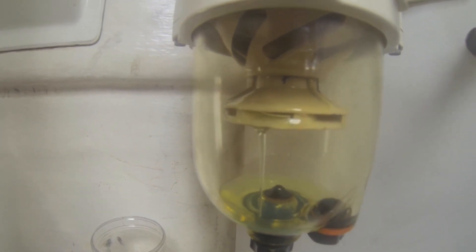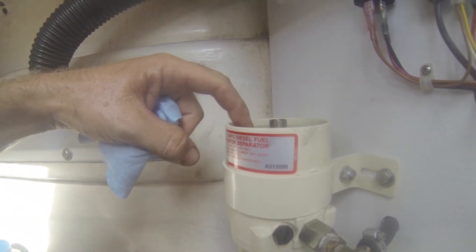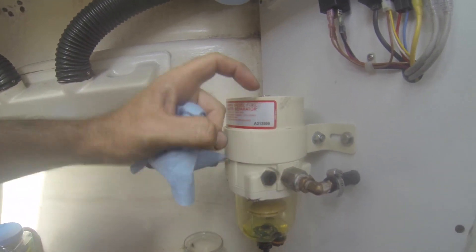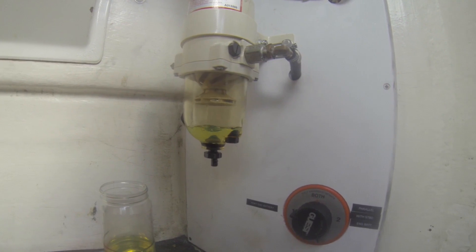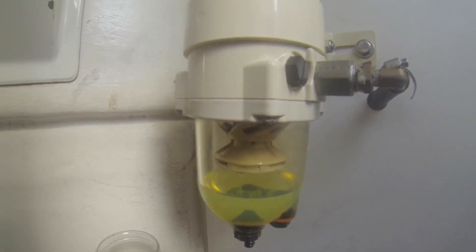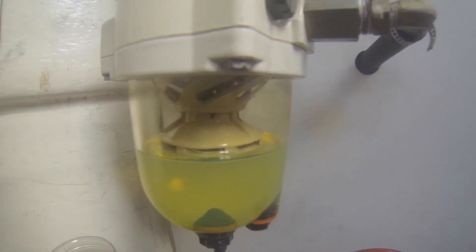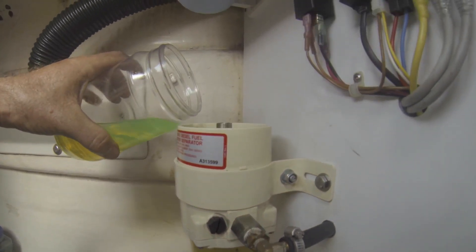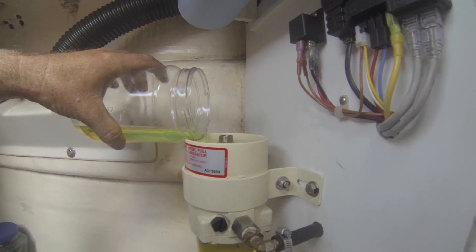That'll take about 10 minutes to fill that bowl from the trickle from the tanks. Once it's full, we take this clean diesel and we dump it in up here, because this is where the fuel is coming in and the fuel will only fill up to that point — it won't rise up this way. Once it's filled up to here, I'm going to dump more fuel in here to cover the fuel filter inside with this clean diesel. You can see the fuel is slowly filling up — we're about half ways. About five minutes later, it's half ways up the glass. You still have to go up a little bit into the casing as well. It's now filled the bowl from gravity feeding from the tank.